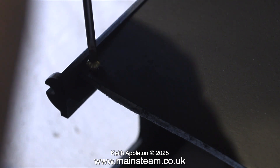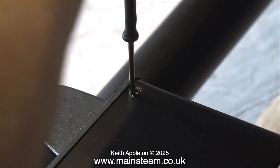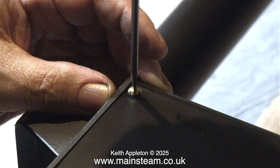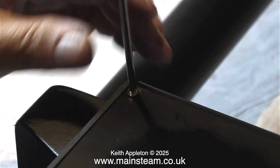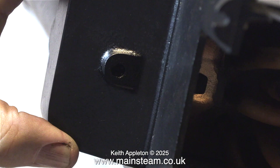The length of the bottom bolts is really not important. Here I'm using a small screwdriver for two reasons: first, to make a hole in the heat insulation, and second, to make it easier to align the bolt — or should I call it a machine screw? — with the hole in the casting. Underneath the front of the 504 boiler someone has made a hole for a pipe from a condenser to go up the chimney to exhaust the steam. Pity it's not in the middle.